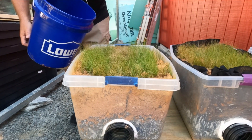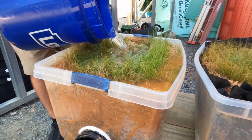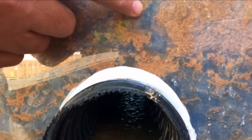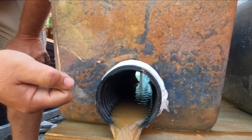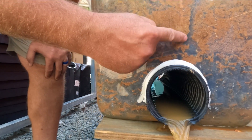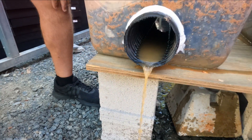Let's pour — about four gallons, trying to be as even as possible. A lot of this water is going to make it through very quickly. Now look — you can see the cracks in the soil where the water is going through. When the soil gets saturated it'll seal up, which is normal. On the first rainstorm the soil is super dry, it finds the cracks and runs through — but look what it's taking with it: soil flowing right into your French drain because it's not filtered. Not good.